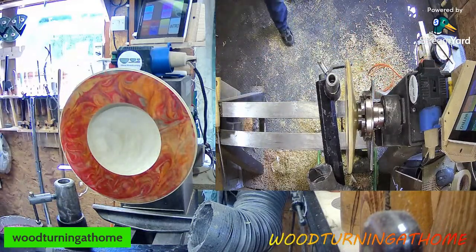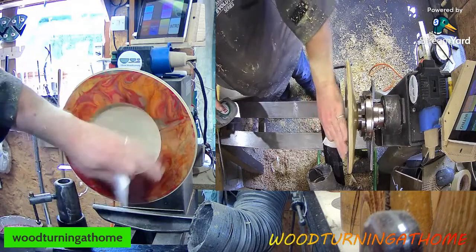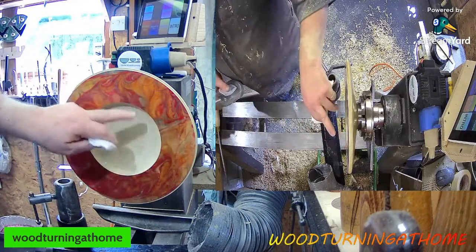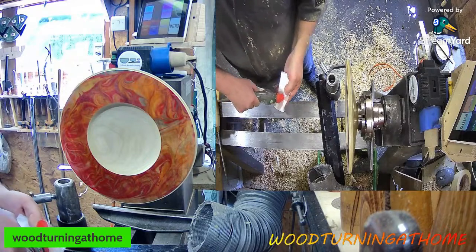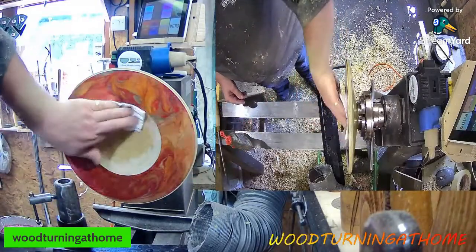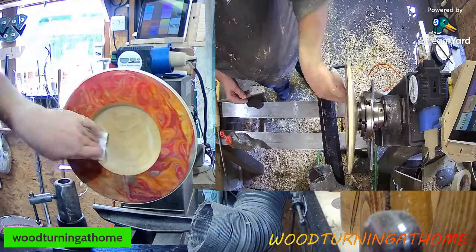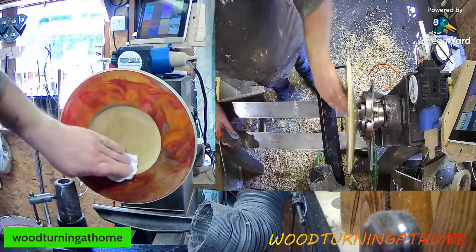Right. I'm going to apply a taste of sand sealer to this. Just watch when you're applying your finish, your sand sealer, that you don't hit the paint because it will lift it off. I have given that 3 coats of lacquer and sanded them back with 400 lately, just to denib them from the wee bits. So I just realized I should have used the spray can of lacquer. On Friday I purposely bought 2 cans of sand sealer to do this so that I could spray it on.